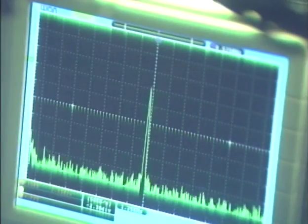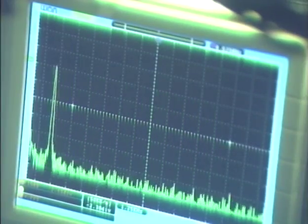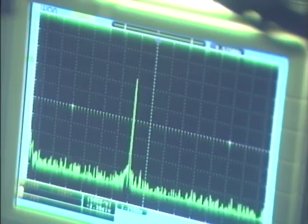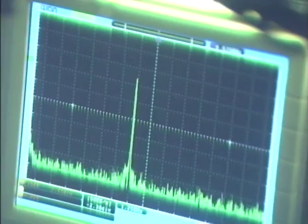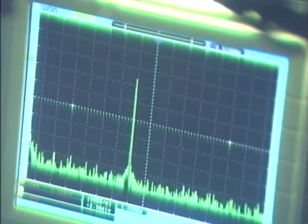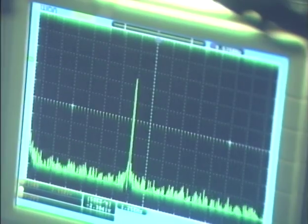So with that being stated, I'll give you another little bit closer view of one of the analyzers and see what the wave's doing. What I'm going to do is stop the sweep right about where the azimuth adjustment is normally done. Most alignment tapes have the azimuth adjustment using a frequency of around 7 or 8K. That's kilohertz, 1,000 cycles per second.